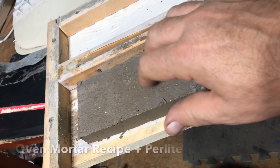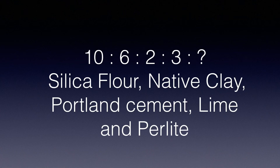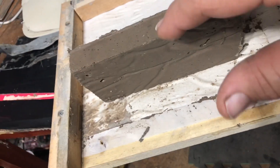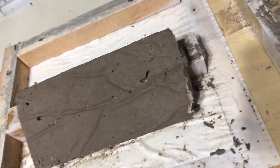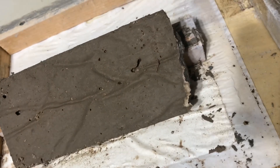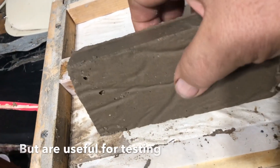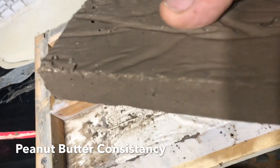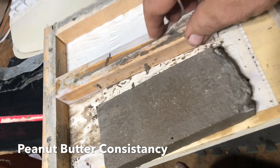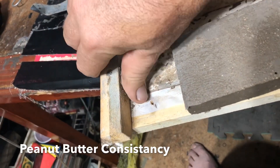This is an experimental block, probably my nicest brick yet. It's a short brick — wasn't quite enough for the mold. The ridge on top, as you can see, the sides are very nice and the bottom reflects the wrinkles on the paper. If a person were to use a piece of contact paper in the bottom instead, it would come out better. When I filled the mold, I took my spatula and pushed the refractory up against the corners.